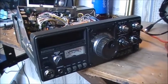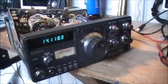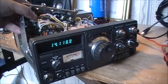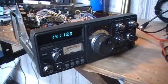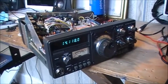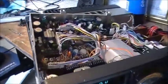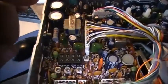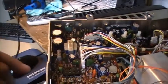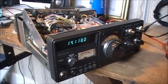Be the first to see a TS-130 come back to life once again. There we go! Now I can press on this board and nothing should happen. One TS-130, nice and happy again. So if you've got a TS-130 and the display doesn't want to work, start with this board first — re-solder the connections on this regulator and on this transistor. If those two don't bring it back, continue re-soldering more joints. This should fix the problem permanently. Fingers crossed.